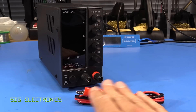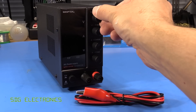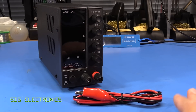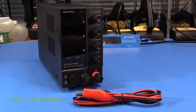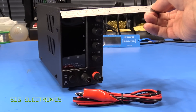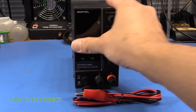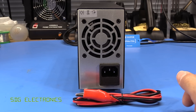It's a really good price for something with this voltage and current range, although the actual device itself is very basic — you really just have the voltage control and the current control, no preview. To set the current you have to short the terminals, set the current up to the limit you want, then remove the short and use it as you'd like. Pretty basic operation, a bit like the old school lab power supplies. It's also a really compact unit — a nice form factor at about 120 millimeters high by 70 millimeters wide and about 150 millimeters deep, fairly lightweight. It's obviously got a switch mode converter in it. On the back we've just got a fan and an IEC connector. Let's power it up and have a look at what it's like.